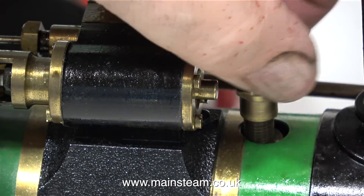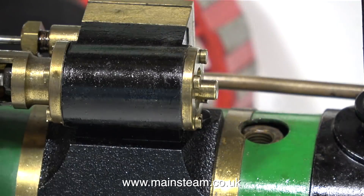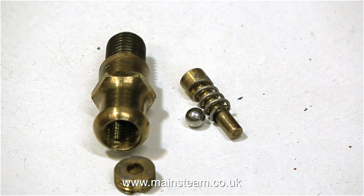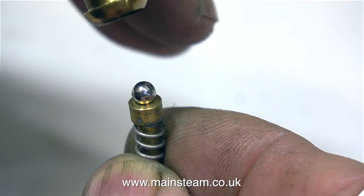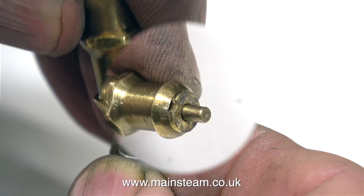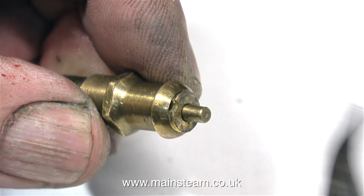In the last episode, even though the pressure went up to nearly 100 pounds per square inch, the safety valve didn't blow off. The spring is far too strong, and here it is in pieces on the bench. This spring is ridiculous — it was not the one fitted to the engine when it was new. A spring of this thickness is absolutely no good when there's such a small ball on the seat inside the safety valve. It would take a lot of pressure to lift this small ball off the seat with that spring above it.